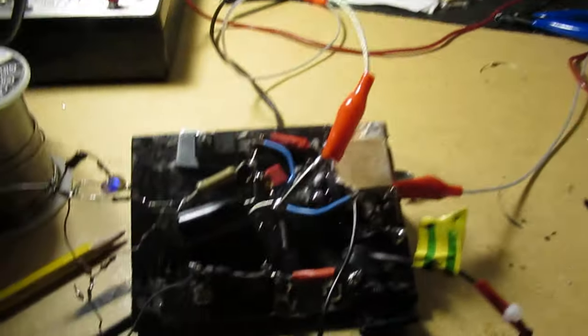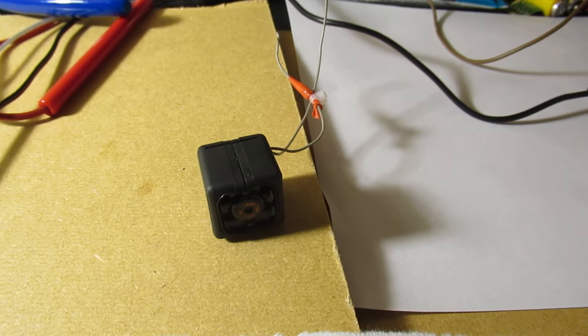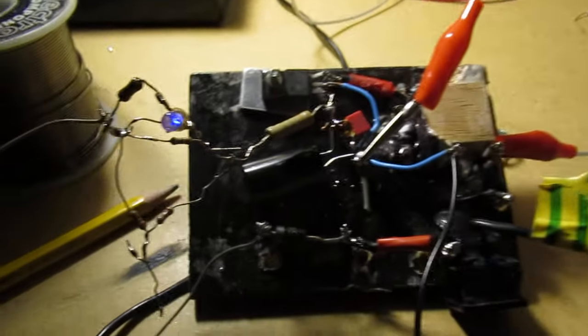But I made here, with the help of that LED, a mode where you can surely see that the camera is recording. When the LED burns, and you have pushed it 10 times or 15 times, left and right, etc., when that LED burns, you can be sure that the camera takes approximately 150 milliampere. And that means that it is recording.